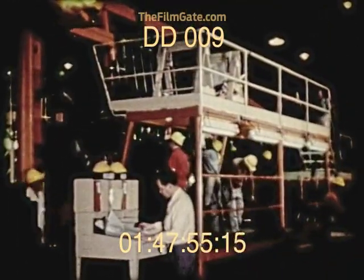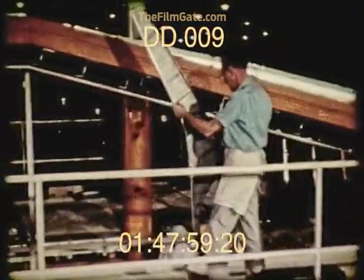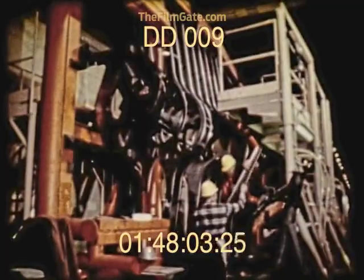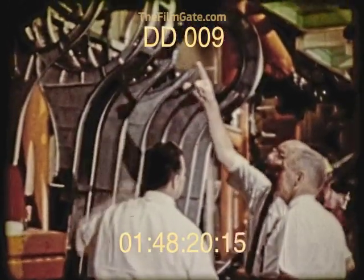After sub-assembly, aircraft bulkheads and frames are riveted in place in this main fuselage structure fixture. Two of these jigs permit alternate and steady supply of airframes to the pickup station, wing mating area, and final assembly. Tool designers constantly check the fixture and jig design to ensure the accuracy and the most rapid manufacturing technique possible.